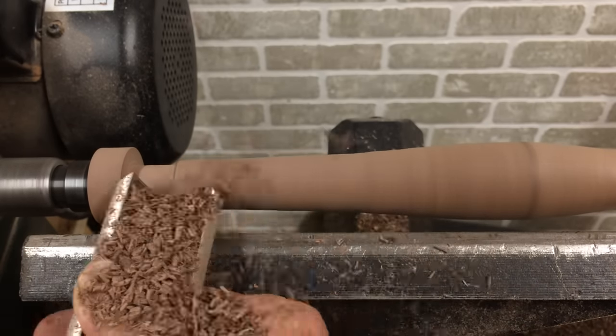To fit the legs here I need to clear out the old glue, so I'm just going to run this drill bit backwards and get it to the bottom of the hole. I'm letting the drill bit go backwards and it wants to follow the natural angle of that hole. So now I'm at the bottom - I'll put it forward and clear out the old glue. This mortise is really nasty and it's actually smaller than it should be. You can see part of the old tenon here - this is the one where someone had put a dowel on - and look at the globs of glue. No wonder this is starting to fall apart.